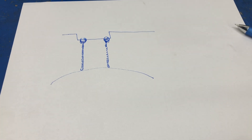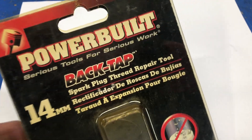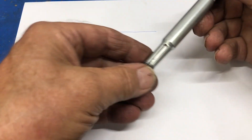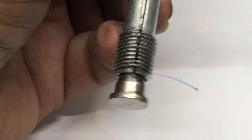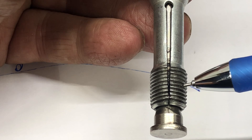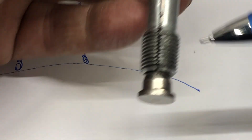There's a tool that I've had for quite a long time now, and it works exceptionally well specifically for this job. Here it is - it's called the Back Tap. It's a trademark name and they're available in quite a few different places. So let me get it out of the package and I'll show you what it does. I would call this more of a thread chaser than a tap, because if you had a drilled hole and you decided you were going to tap it, this won't do it. This is for following a thread.